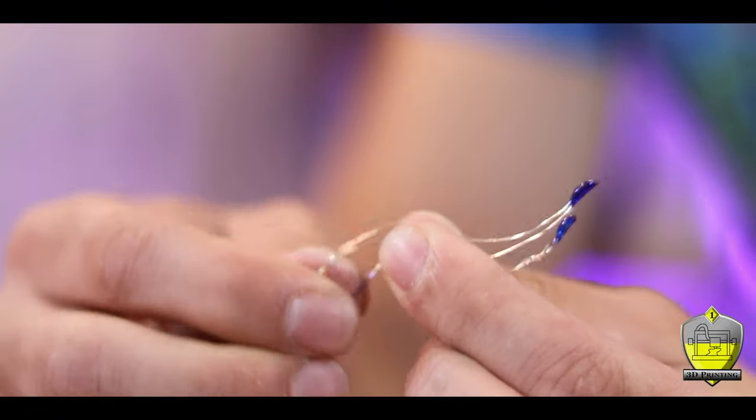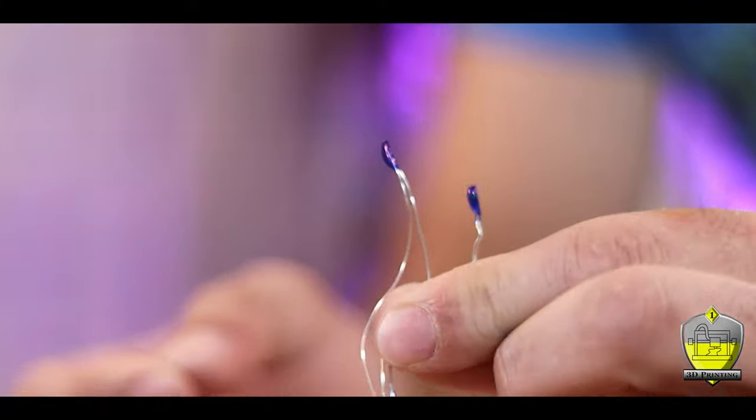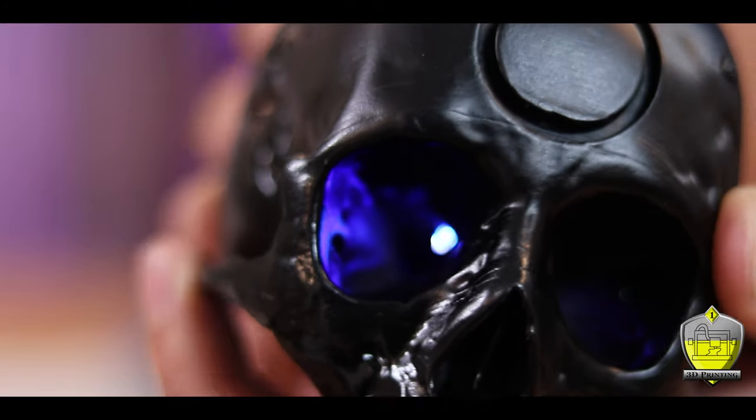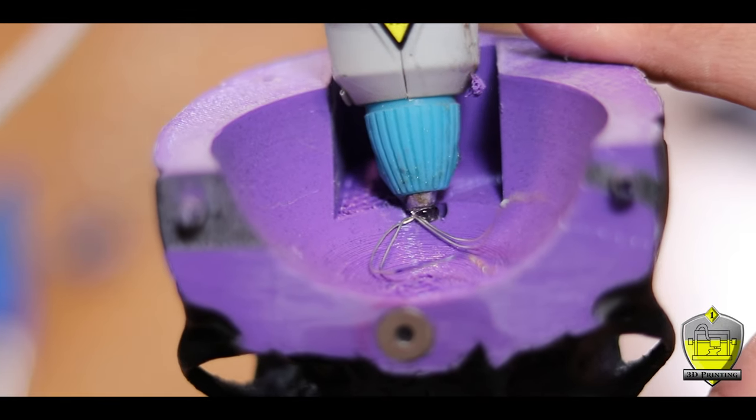To get those eyes glowing, I took two of these LEDs and twisted their legs together, positive to positive and negative to negative. FYI, LEDs operate off of direct current — so if you don't have the legs touching the right sides of the batteries, they're not going to work. To figure out which one you need, just touch the legs to either side of your battery and see which way it lights up, then mark one of your legs so you don't lose track of which is which. Once those two eye LEDs were connected together, I fished them into the little tunnels I built into my print, which led directly down to the eyes. With them in a position I liked, I locked them in place with some hot glue.